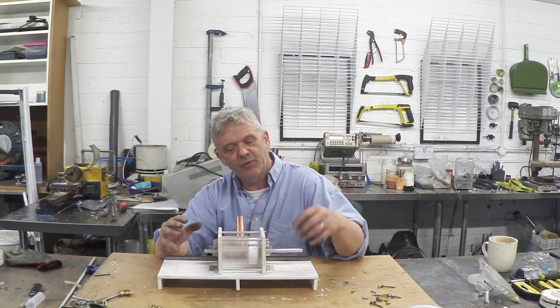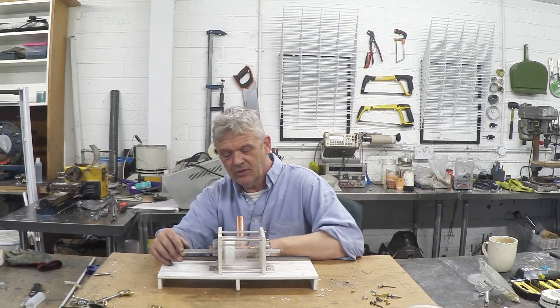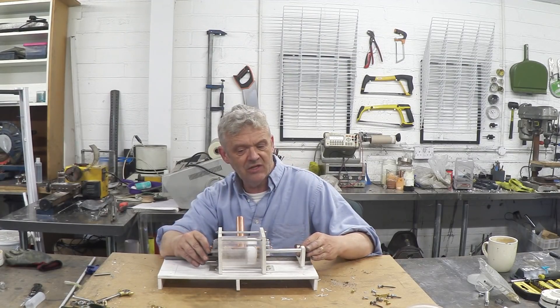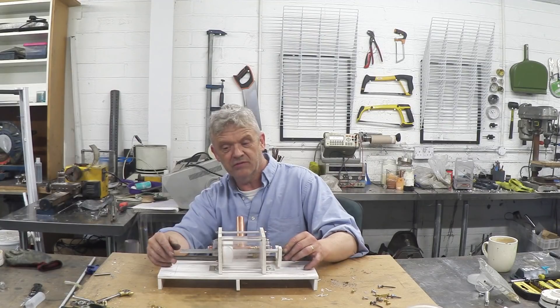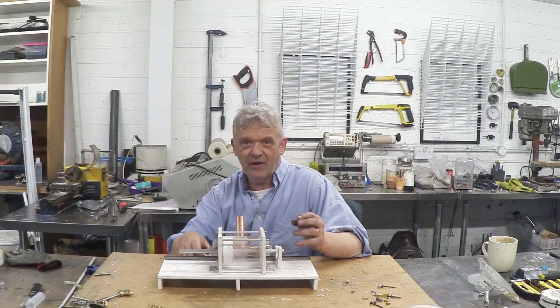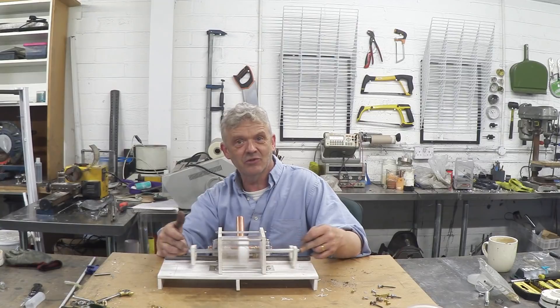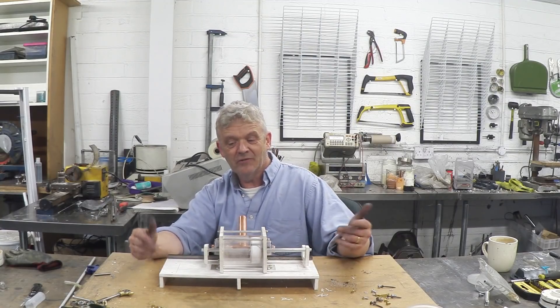Because of the piston timing and the valve timing, this actually works in one direction — if I'm blowing it, putting a vacuum on won't work unfortunately. If I'm blowing, that piston should be forced to the other side. The valve, because it's attached to nothing, won't do anything unless I attach it to something. So it occurred to me to put a slider on the piston — as I blow in and the piston travels down, it'll hit the valve and push it to the other side, ready to go back the other way.